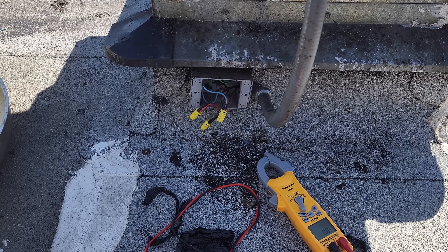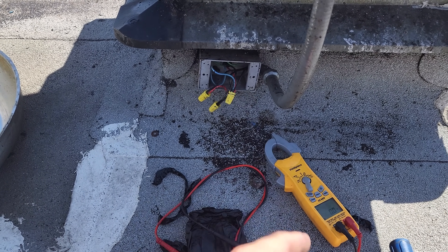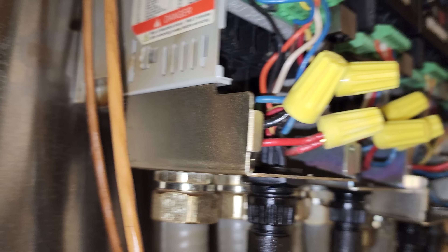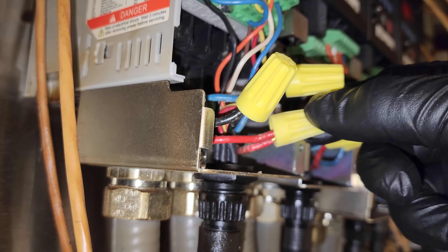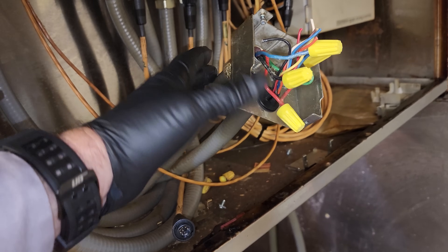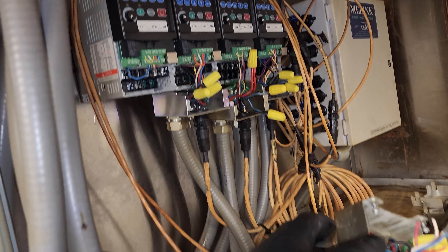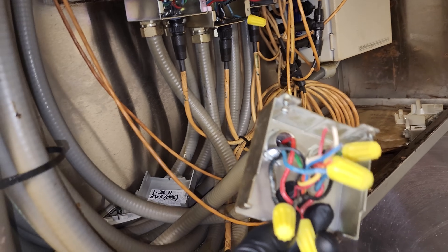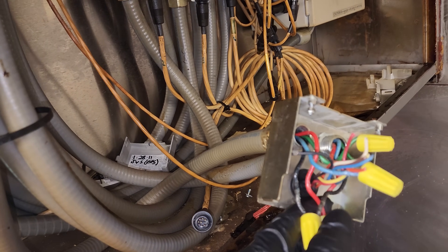So this is a problem. We need to go downstairs and look at the connection points from the breaker up to here. These motor starters are bypassed. I have power turned off — notice how this wire is moving but the bottom one isn't. We're not making a good electrical connection. Because they have the motor starters bypassed, this becomes a junction point. The motor starters have failed and they had a loose wire. We tightened it up — this red wire was the problem, so we went ahead and reconnected it.